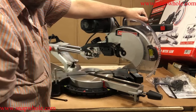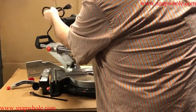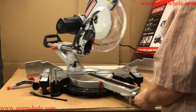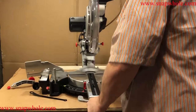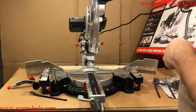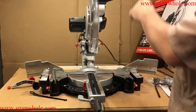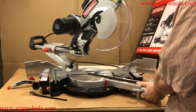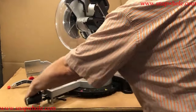You can adjust how far down the blade goes, so it can be less. Pull it out of the way and it becomes a stop that won't let it go down; push it in and it lets it go down. You can turn the bolt to make it stick up further, and it has a lock — the back one has the same thing. So once you decide you want the blade to go a certain distance down, you can lock that in place. It's about a five-foot power cord, and that's a problem — when you rotate, it's going to lock the cord.